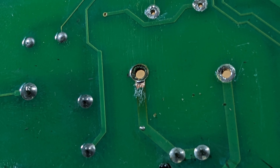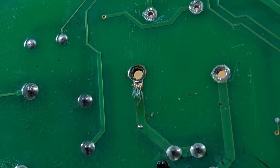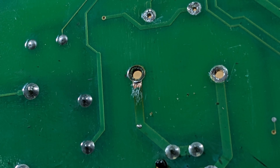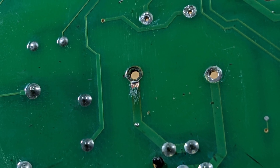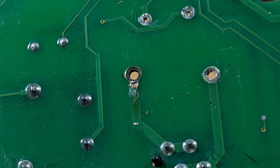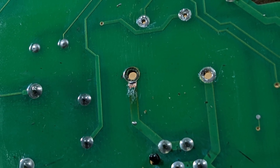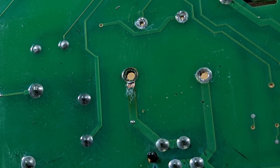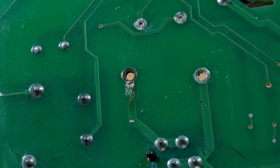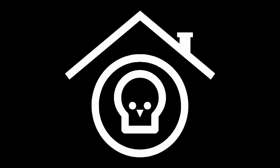In the end, I didn't actually need a new relay. I could have left the relay in place, cleaned things up, scraped back the solder mask, and done a fresh solder joint on that one bad pin — and I would have been back in business. I think a lot of people change relays unnecessarily, and in the process of changing the relay they just redo that bad solder joint. That bad solder joint was the culprit. Thanks for watching, hope you enjoyed it, and we'll see you next time.